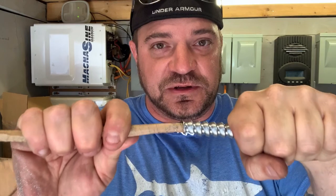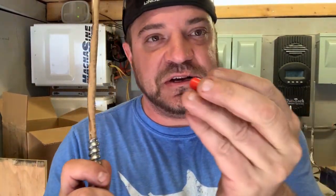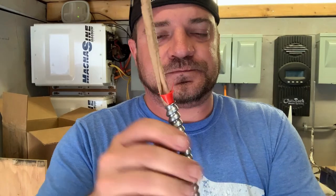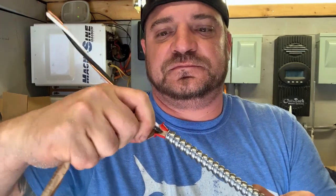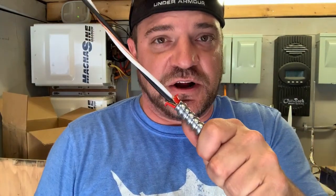This exposes the end of the wire. There's a paper coating inside that protects the inside of the wire and helps with anti-shorting. To go one step further, we always install an anti-short bushing on top of the conductors. We squeeze that in there nice and tight, and then we pull off the paper coating.